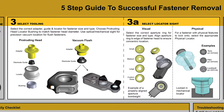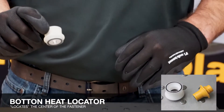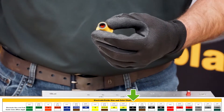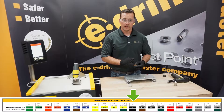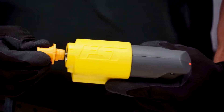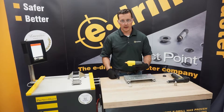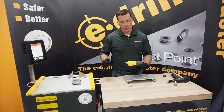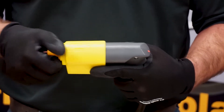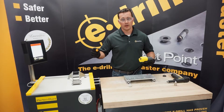Step three is to install the tooling, and that's based off of whatever fastener you're cutting. I'm cutting a protruding head fastener, so I'm going to use my protruding head locator and my protruding head adapter and guide. Notice the guide is black — that's the color code we talked about earlier for a size eight electrode, so we get a black guide. To install this, put it down, push it in all the way till it's seated, and give it a quarter turn. Now we are locked in and ready to go. When removing the adapter, make sure you're pulling out while you turn — it pops right off. Many times people will not pull out and will just turn all the way back, which gets you locked back into place. So pull out while you turn and it slides right off.